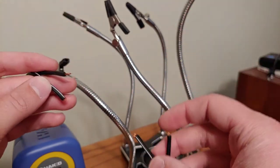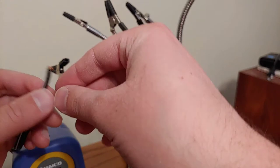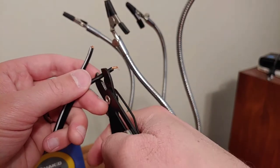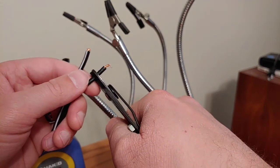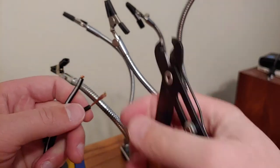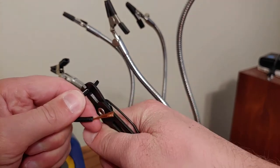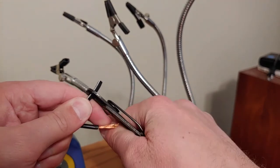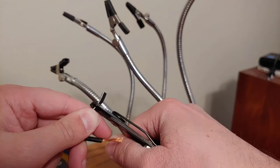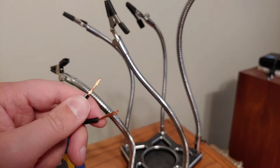I'm going to set these up on the helping hand and then we'll actually solder it together. Oh actually, before we do that - almost forgot - so we're going to take our wire cutters real quick here and I'm just going to take off some of this extra wire so we can have a nice clean part to solder together. You don't want to push too hard on these wires - you want to do just enough so you can get through the plastic. You don't actually want to cut the copper.